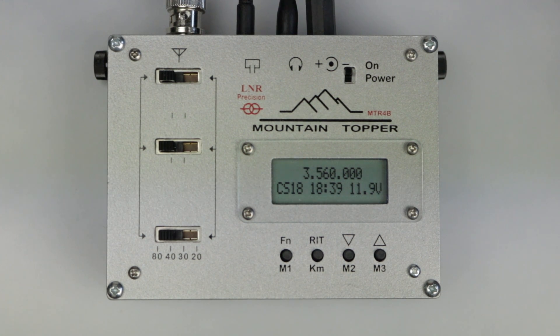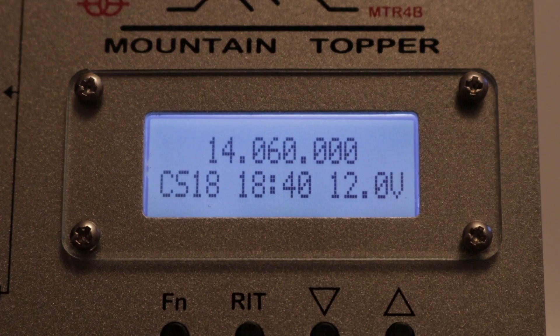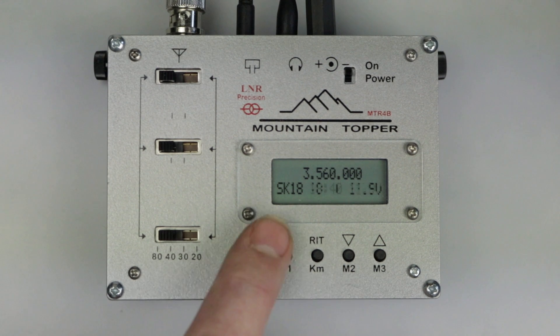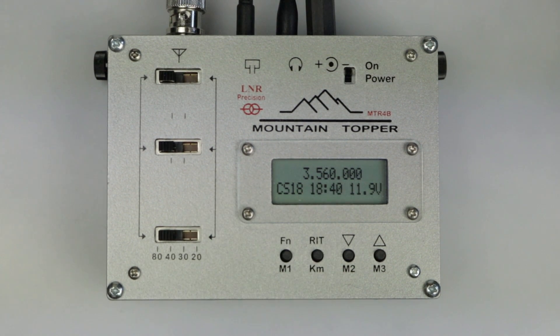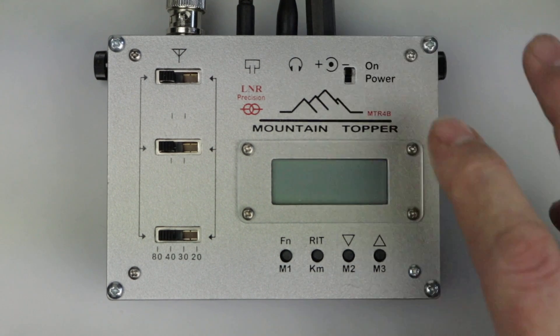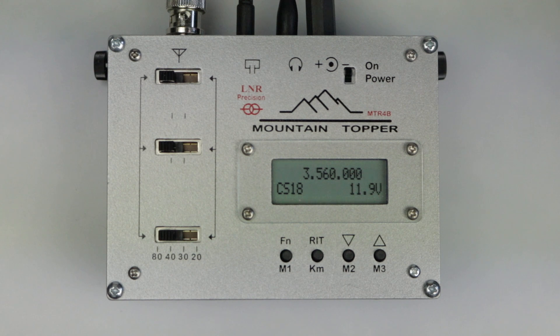The 16-character two-line LCD display is easy to read and backlit with a whitish hue which looks great. The display shows the frequency, the keyer speed and a prefix indicating straight key or paddle mode, the time, and the battery voltage. You can power up the radio with a mono plug into the key socket to put it into straight key mode, or tap function followed by the RIT button to switch between straight key and paddle. To retain the time you'll need a small internal 3-volt lithium button cell, a CR1225 or equivalent. Without it, the time can be entered each time you power up but will be lost on power cycle. All other configuration settings like message memories are retained in flash memory and do not need the internal button battery.